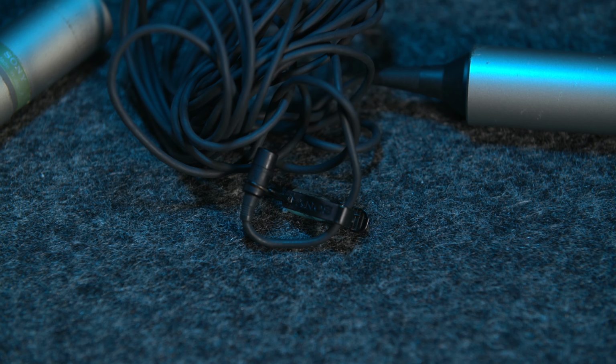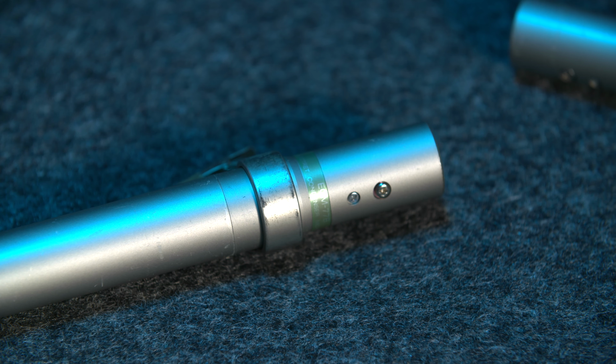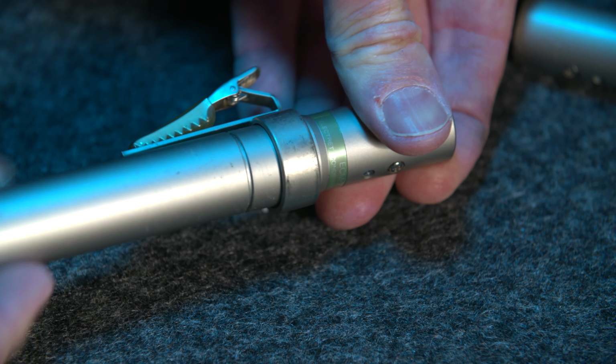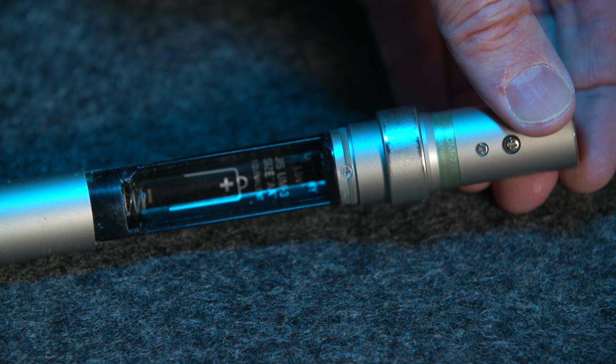For instance, this lapel mic is an electret condenser microphone and is powered by a AA battery down the bottom of the microphone. It's a balanced microphone, so the signal coming back to the broadcast equipment doesn't see that voltage. The voltage is only seen on the microphone element.